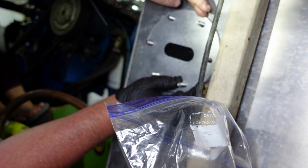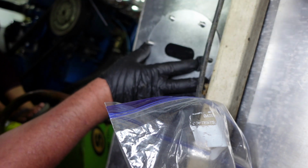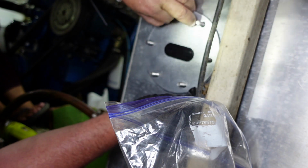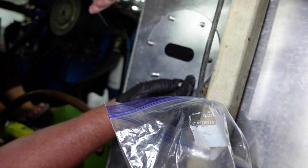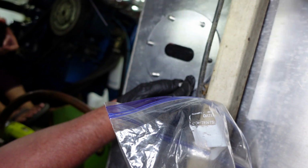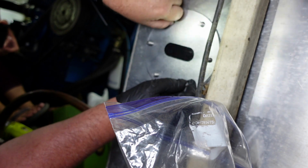Now I got to clean out the tank, so that was the hard part. You can see there's some slop in the holes. So the holes are not close tolerance. The gaskets will make up the difference and seal the areas that need to be sealed. The trick to this system is that the backs of these are studs going through the backing plate, and they are sealed into the metal ring. I can see those are close tolerance. I think they're pressed in, probably along with some Loctite.